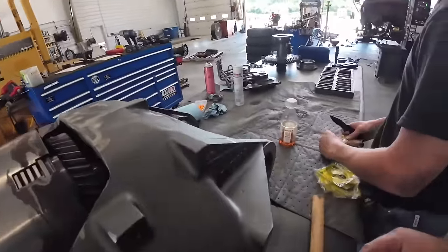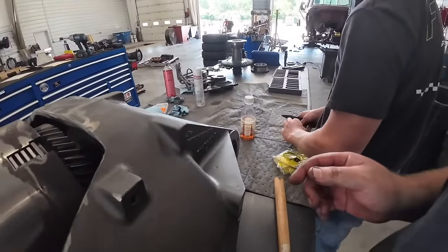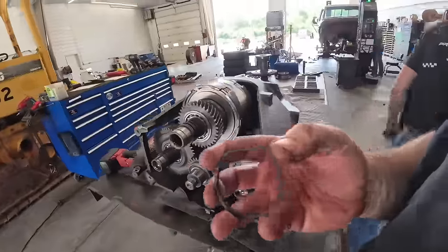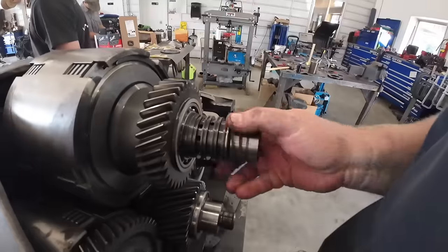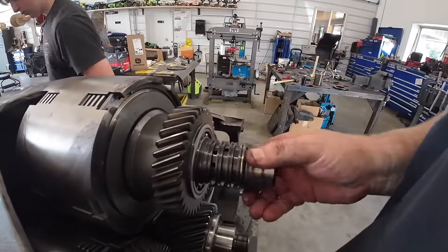All right, got that slit in there. Tucker's opening up the cast iron sealing rings. I'm gonna replace those. Guy might be able to reuse them. This is all that seals the oil up, like a piston ring, basically. We've got all these holes in here, as I said before. Those all do a different function. So there's just a sealing ring on each side of the ports. All it seals the oil up on these things.